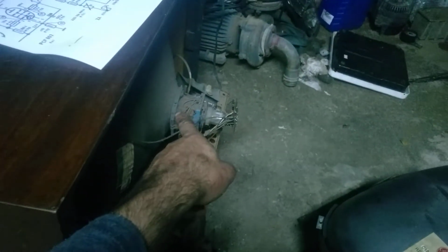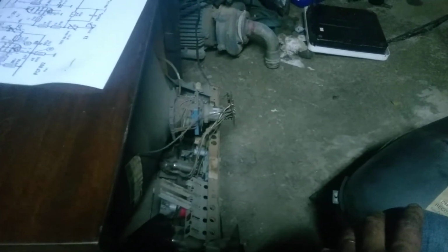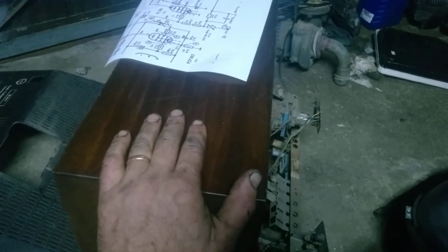So what I'm thinking here is that I tried wiring this TV back to back into one of these rectangular CRTs, and it works very well. The pinout is the same, the ratings are similar, the deflection angle is the same, and it actually displays a nice picture in one of these rectangulars with good linearity, full deflection, etc. So I'm thinking about fitting this rectangular CRT into there.